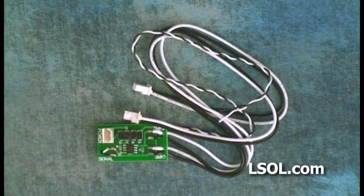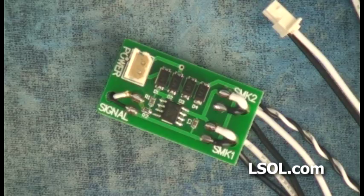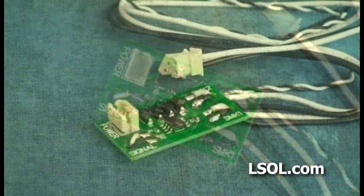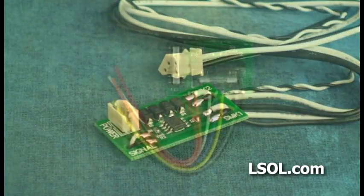In order to control a smoke generator, which has a relatively high power draw, a smoke controller board is included and has been designed to work with the Revolution TE receiver. This smoke control board has been designed to be used with the auxiliary control harness to remotely operate smoke generators by acting as an electronic switch or relay. The smoke control board has the ability to operate 2 smoke generators simultaneously.